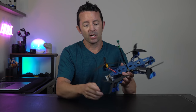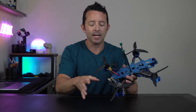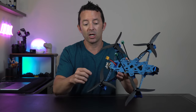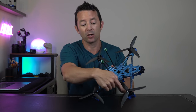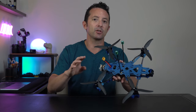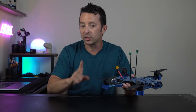When you mount the motors to the motor plates, there is no definitive top, bottom, left, or right — you can mount it to either side. But do keep in mind that what side you mount it on, the motor wires will lean to one side or another. You'll probably want your motor wires going to the inside of the arm on both sides so that you can get to the pads. Keep that in mind so you have two going to one side and two to the other. I had to go back and change that on one.